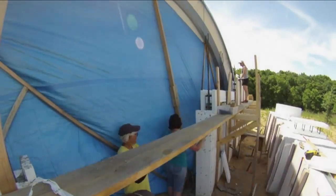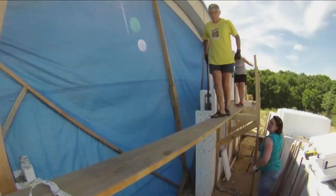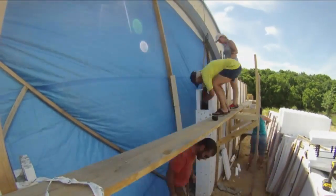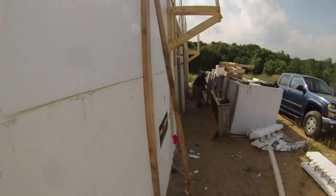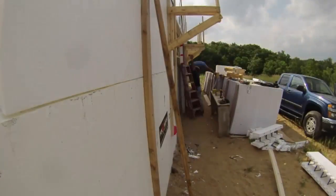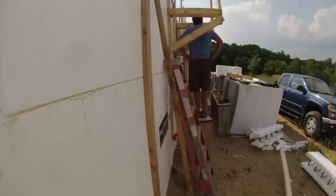Those white panels on the side are the Fox Blocks. Here they form the side of the rear garage door — just instead of like 2x12s. After a few layers, it becomes more difficult to add more Fox Blocks and to reach inside and connect all the clips, so we just raise those scaffold jacks up a few feet and keep working.